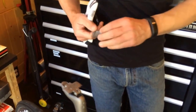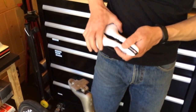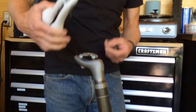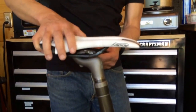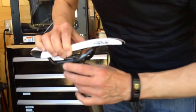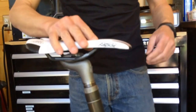The saddle rests on a 3D-printed cradle, which has a center ridge that runs along a track inside the base here. To get your saddle onto the post in the first place, it's super simple — you don't need to have parts falling all over the place. You just put your saddle in, get the clamp bolts a little bit loose, and then you can slide this little cradle right into the bottom. The raised part nestles right into the track, and you just put it down there.